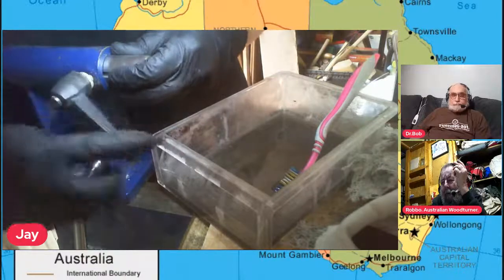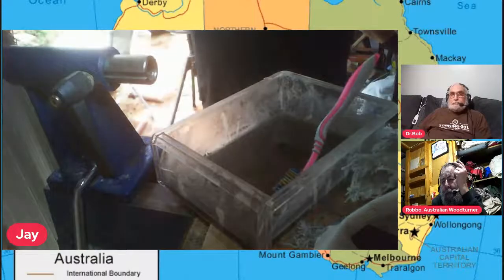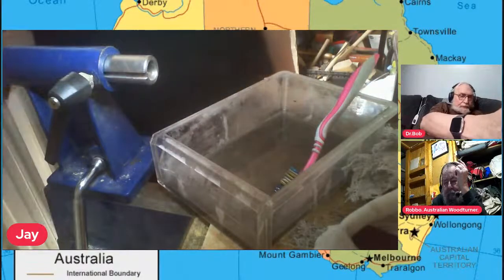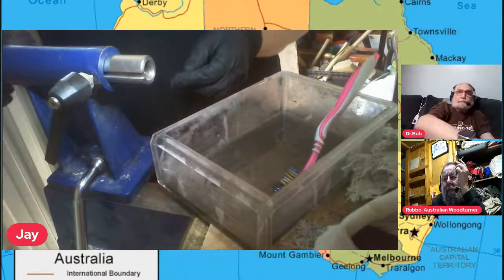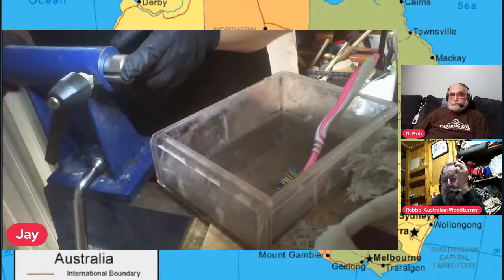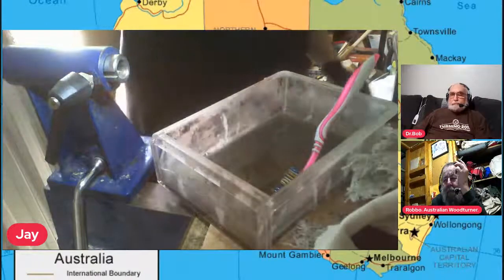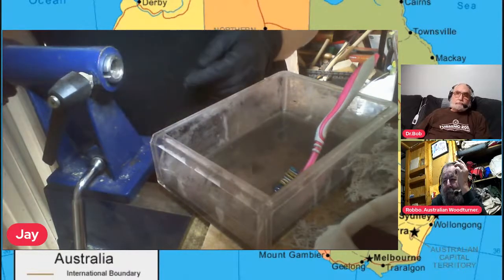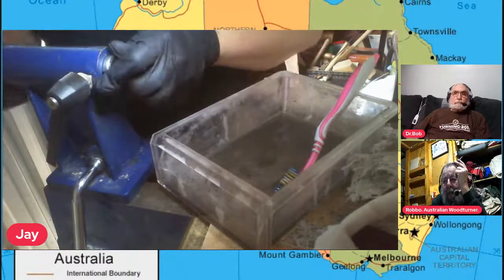How you going, Robert? Yep. Right. Now, just loosen the spindle lock off so it's not tight. Right. Now, see if you can screw the tailstock back with where the handle would go, where the hand wheel would go. Just keep pressure on that, on the face, otherwise it'll just disappear in. Is that as far as it goes? No, that turns pretty easy. Yeah, see if it goes right back. See if it goes back further? No, that's it. Right, okay.